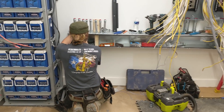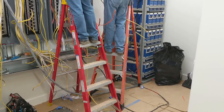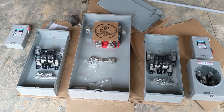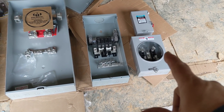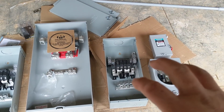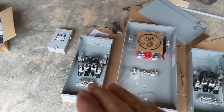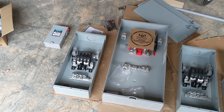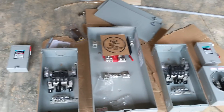This awesome mech room — you can see some other cool goodies in here. We're gonna have some chillers and buffering tanks; they should be in tomorrow. Here's the layout for the service entrance that's still not built yet. We're gonna have a generation meter and the main meter. Half of the system is going to be grid-tie sell-back, and then the other half of the solar will not be — it'll be zero export or limited power to home. Nothing will be exported beyond this point to the grid.